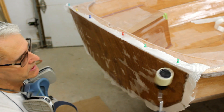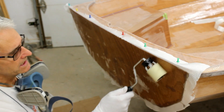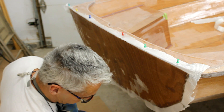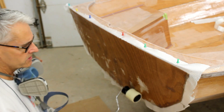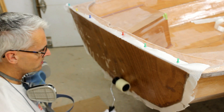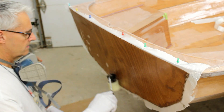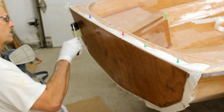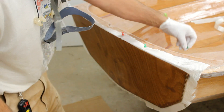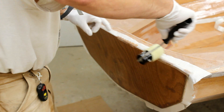I think I've got enough epoxy on my roller and on the surface, so now it's just a matter of forcing it down and wetting it out. I also could have applied the epoxy with a brush — not so sure that would have been any less messy, as we do have epoxy dripping on the cardboard. With that pretty well stuck, I think I can pull the pins and just saturate this top edge here.